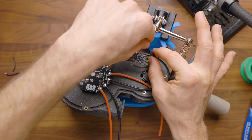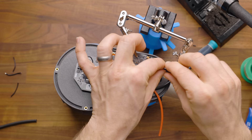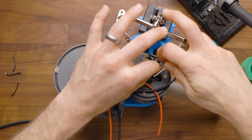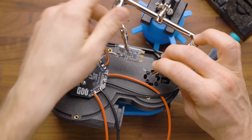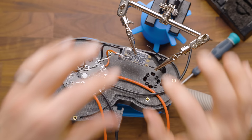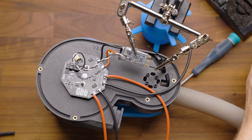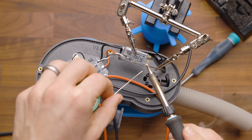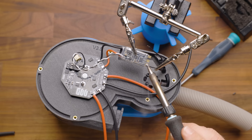Always make sure that you're either blowing on this or letting it cool. When I'm not doing a tutorial for a video, we do use a little filter box solder thing with an activated charcoal filter. One of our team members Greg had suggested picking one of those up, and it was definitely a good purchase. I'll do the second one here — these will take a little longer than you would think. You don't want to overheat them because you could fry something. I just made myself nervous that I flipped them around — again, it should be one, two, three, and one, two, three matching in order.